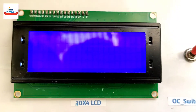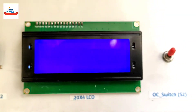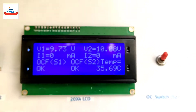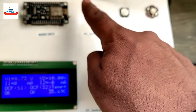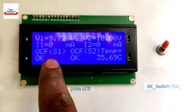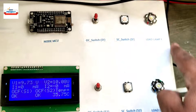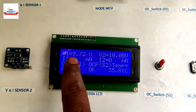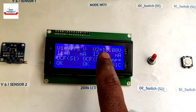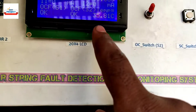The project name is appearing on the LCD, then we can see the parameters. Current is showing zero for both S1 and S2 because the circuit is currently open — the switches are off, the load is off, so it is open circuited. That's why current is zero. Here is the voltage for solar panel one and here is the voltage for solar panel two.